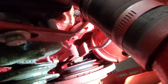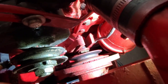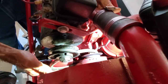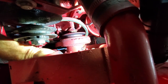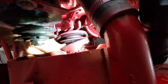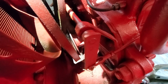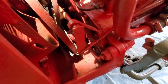Hopefully we've got this thing loose enough. A lot of people will take the radiator shroud off — we're going to try to do it without that. It may be a little difficult, but we'll see if we can do it without having to disassemble the whole front of the tractor. There it goes, it fell down. We want to first try to get this fan belt up and over — we've got to get it off the pulley on the bottom of the motor. It's coming off, though it's a really difficult place to work.